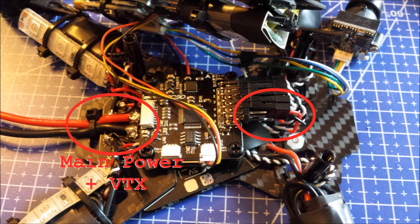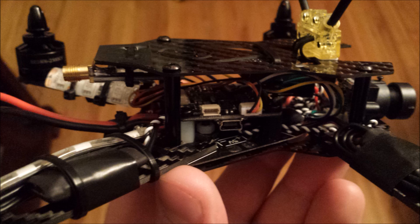I soldered a servo lead to the 5 volt output up front to power the CC3D from 5 volts instead of the main board. This lets me run a 4S battery without pumping 4S voltage through the CC3D — it's guaranteed to work at 5 volts. I soldered the power wires to the main points where the FrSky battery sensor was soldered, and also connected the top camera power directly to the same input since the video transmitter supports wide voltage — 3S, 4S, or 5S with no problem. The 5 volt power goes into channel 5 on the right side. I cut wires short to minimize slop inside the frame, and taped the ESC wires together under the CC3D board to keep things tidy.